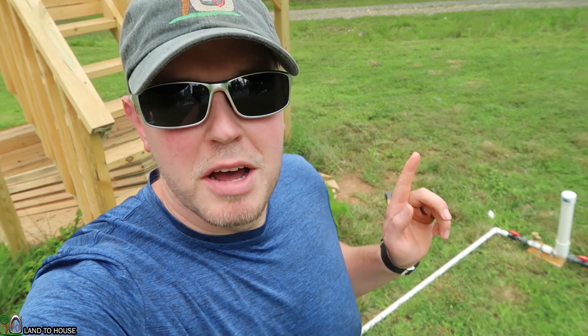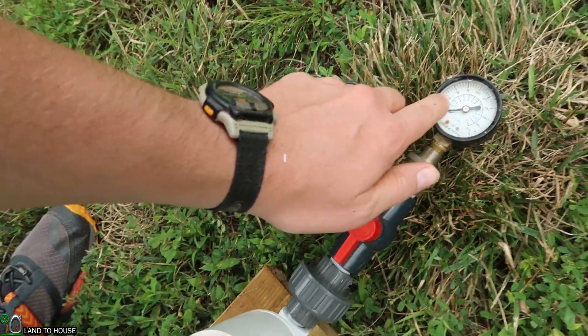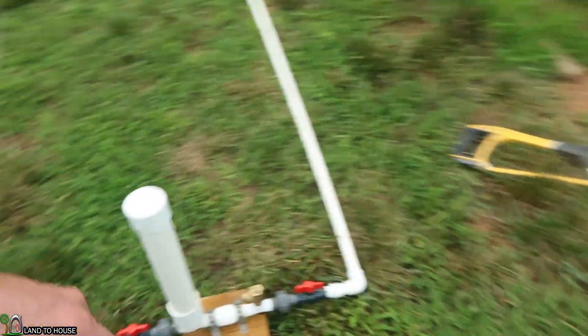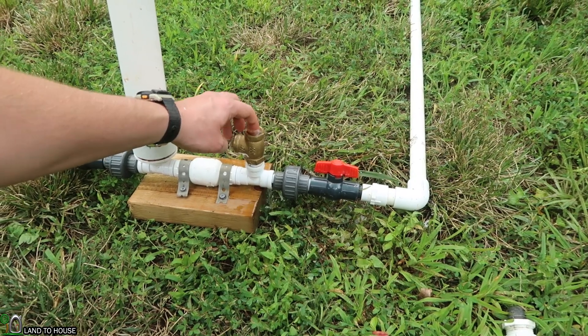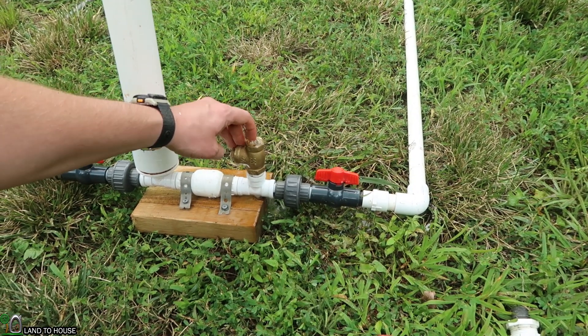Time to check out whether or not the three-quarter inch drive pipe is going to affect the half-inch pump. Before we start this test, remember you can buy the RAM pump on landahouse.com or on Amazon — link in the description down below. Got everything set up. The reading before was actually 42 PSI on the half-inch drive pipe. Let's go ahead and get this started and see what we get. That was quick — I think the water actually travels faster in the bigger pipe here. What I'm expecting to see is a faster cycle time and lower PSI generated.